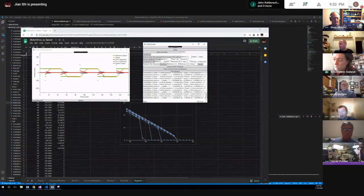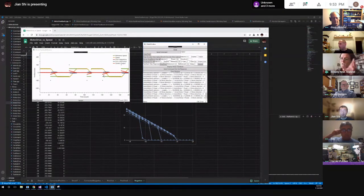But with four wheels, one thing I found pretty quickly was that there's almost no way to predict which wheels are going to slip when you're doing a turn. It depends on the weight of the robot and where the balance of the weight is. Mine's roughly in the center, but even then you still have differences in the surface that you're driving on. I drive on my wood deck, and as the robot rotates, you can see that it slips differently. So I don't think you can predict exactly.